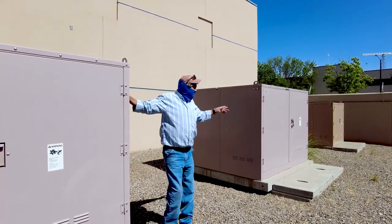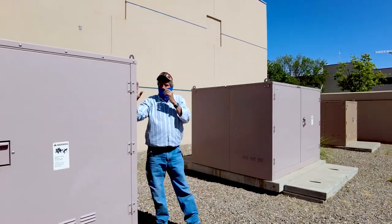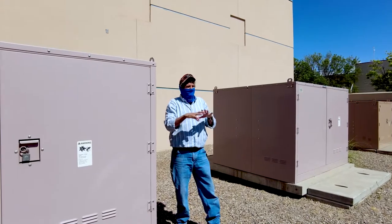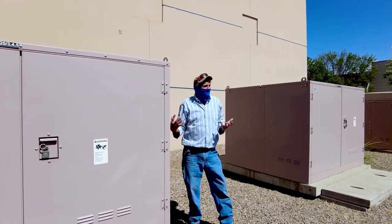This switch and that switch and that switch down there use a vacuum. So there's no air in there, there's no oxygen, there's nothing. So when I open the switch, I don't get an arc and burn everything up.